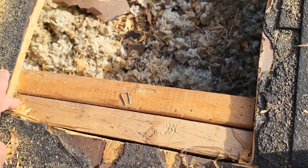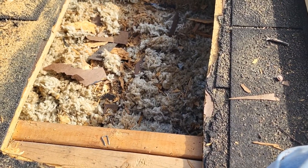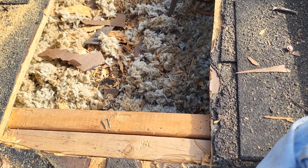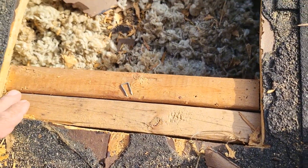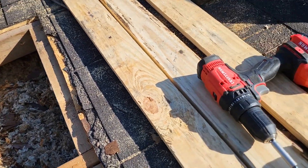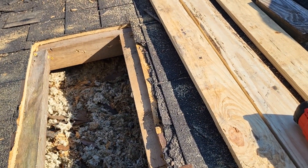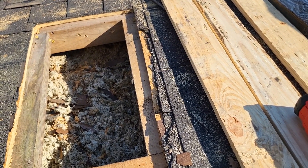I got to clean up the corner right there with a little chisel. Two more two-by-fours — I take a measurement and toenail them in up under there. You can also turn them sideways instead of straight up and down, which will help with the width to get the plywood to sit on and give it more sturdiness. I turned these straight up and down but these I'll turn sideways. The only tools I used were the Craftsman screw gun, battery, Craftsman saw, hammer, my razor knife, and my pencil.